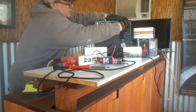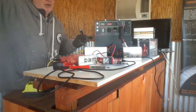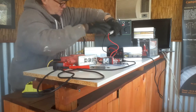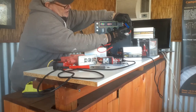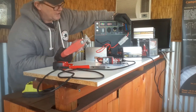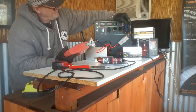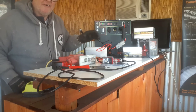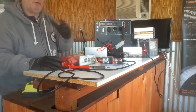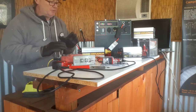Now using the source Nomad to supply power to the inverter — same setup as if a solar panel were the source. I plug the analyzer in between. It shows 11.36 volts and 0.2 amps idle. I turn on the inverter and run the jigsaw flat out — it got to 180 watts, 17 amps. The jigsaw is rated 370 watts but ran at 180 watts. The analyzer tells you exactly what's happening, and checking the back of your accessories lets you know what you're drawing so you don't exceed the Nomad's 20-amp limit.